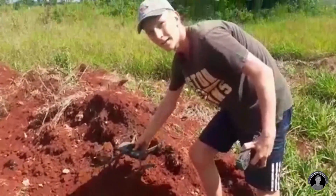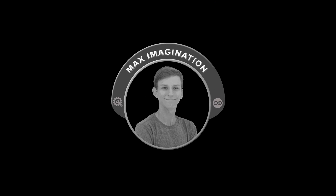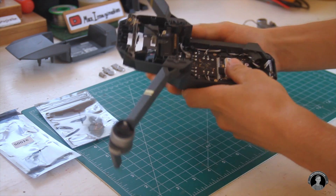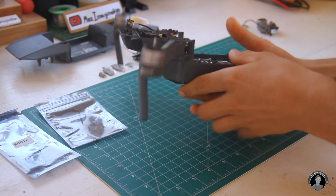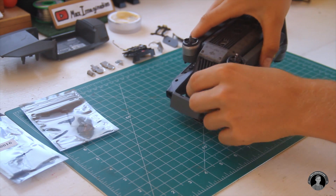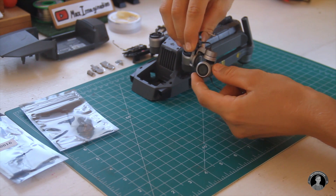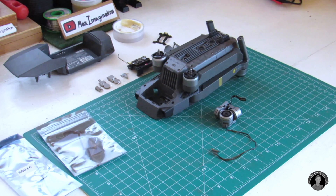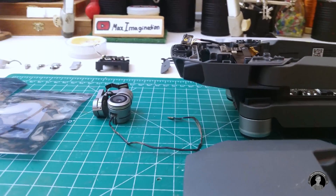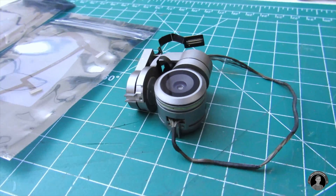Actually, it landed right here — it was pretty easy to find. After the crash, visually nothing seemed wrong with the drone, but after powering it up, instantly I could tell I wasn't getting any video feed and I had no control over the gimbal whatsoever. This led me to the conclusion that it would be the gimbal flex cable and the video signal cable, which are the two things you'll see me replacing in this tutorial. Since I can't show you how I took this drone apart as I didn't film that, you'll just see its reassembly, which is the most crucial part.